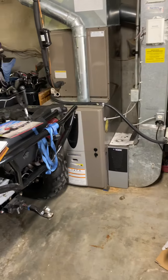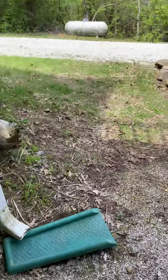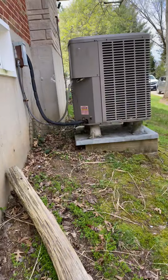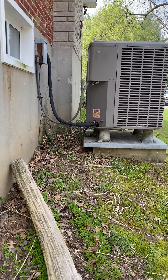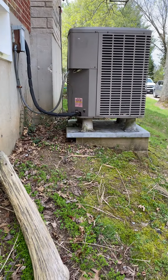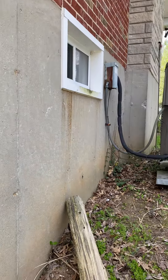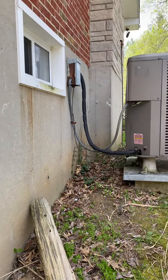That should be everything on the inside. My outdoor unit is right over here — there's a York heat pump right there. We'll pull that heat pump out and set our new unit back down on top of a new pad on top of that concrete pad that's there. We'll do a new electrical shutoff box and electrical whip, and then those refrigerant lines will get replaced.